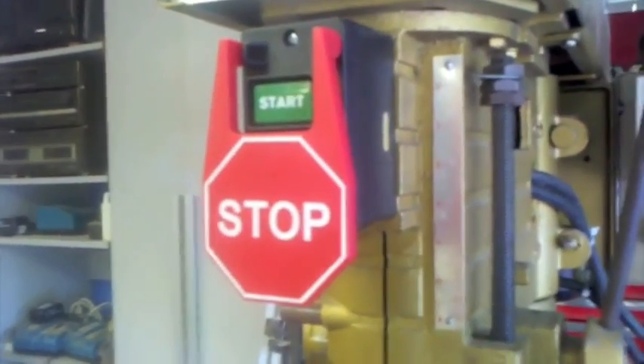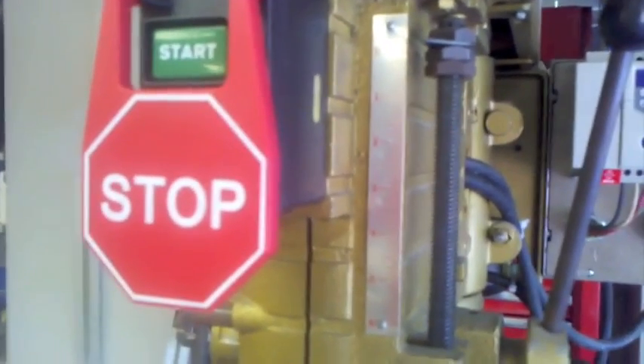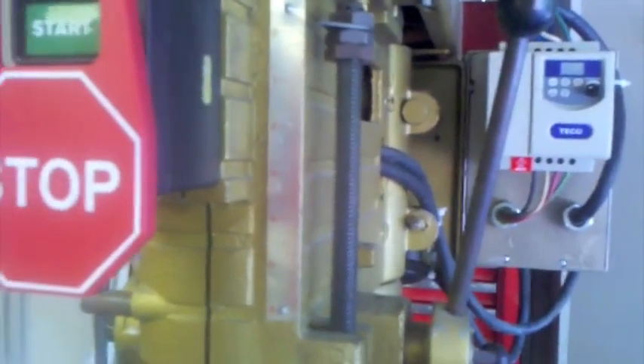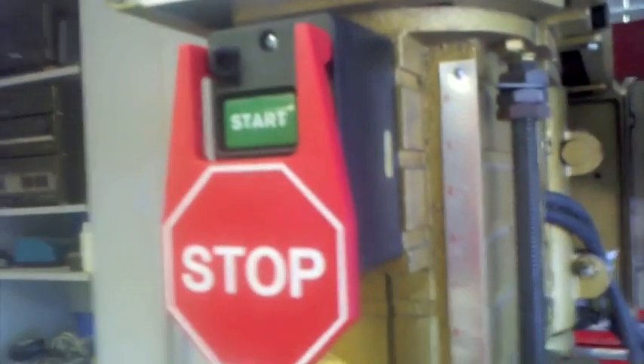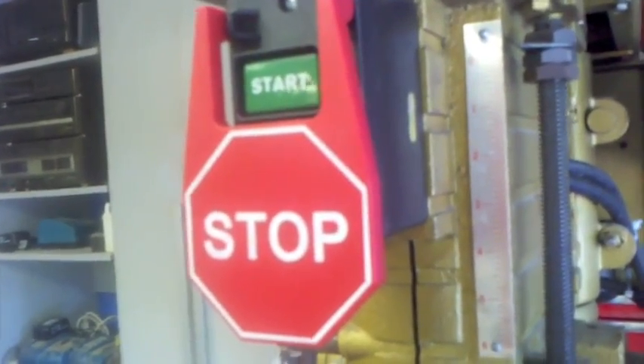I've got a giant stop switch sitting on the front here. I took the original switch out, and looking at the VFD directions, it said to run unswitched — basically going direct from the power source into the VFD. Unfortunately, where I had to mount the VFD, if you were operating the quill and needed to do an emergency shutdown, trying to reach back and fumble for that little bitty stop button could allow a lot of damage. So I picked up this big Rockler router table switch with a large stop button — I'm using it as my emergency stop.